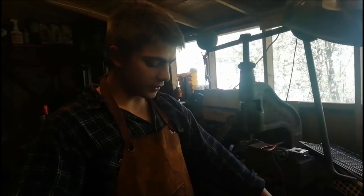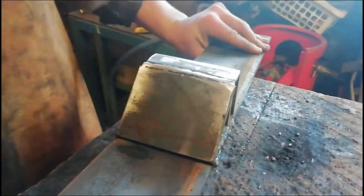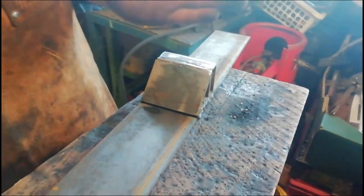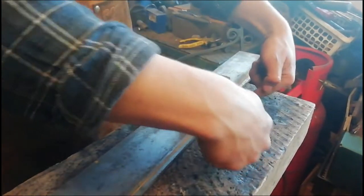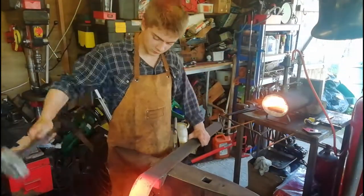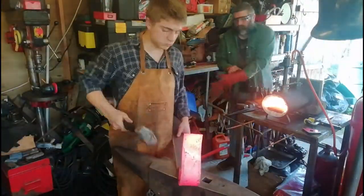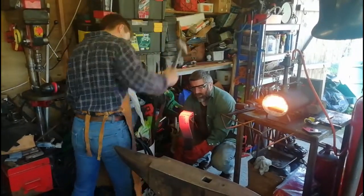We've welded up these sides here, all the long side here. We're not going to be welding into the middle or down there, because as we wrap it over we won't be able to get the grinder in there. So then we'll be able to grind these sides out and the jig will hopefully just pop out. There we go — we're going to weld it in those holes. Perfect.